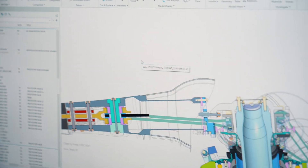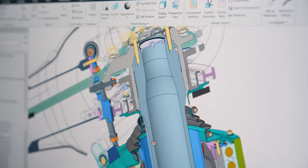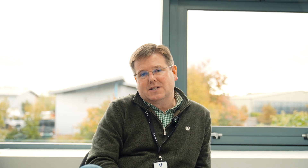The rotor system that we've developed is a high inertia rotor system — there's a lot of mass up there — and the strap-based design and the composite blades allow us to optimise that mass distribution so you've got the highest possible polar moment of inertia. This gives you the longest possible time to get the helicopter into autorotation in the event of an engine failure, and then the easiest flare and cushion at the bottom of the autorotation, again making the helicopter as easy to fly as possible in the hands of people that don't do this sort of thing all the time.